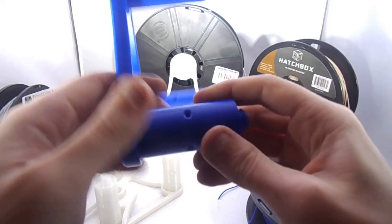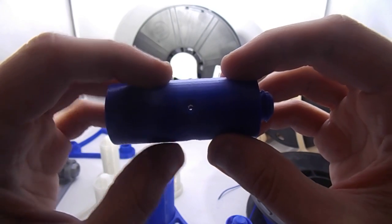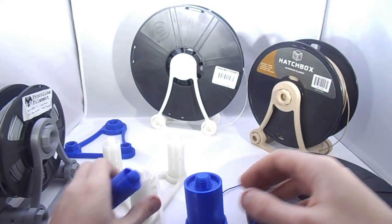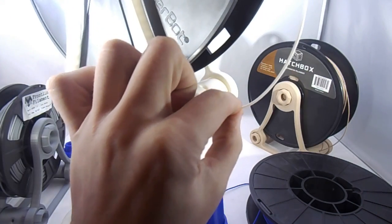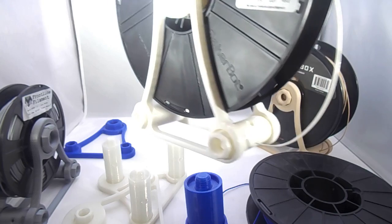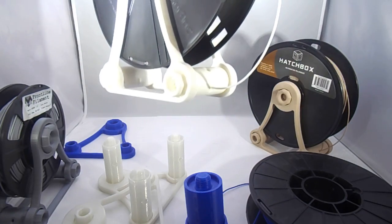Every small rod has little through-holes of about 2.2 millimeters through the center. This is to keep positive control on the end of the filament, because sometimes it's wound too tight and when you let go it'll just unwind, get caught under another layer, and you'll have jams and clogs and air printing. So it's just nice to have control right here on it.